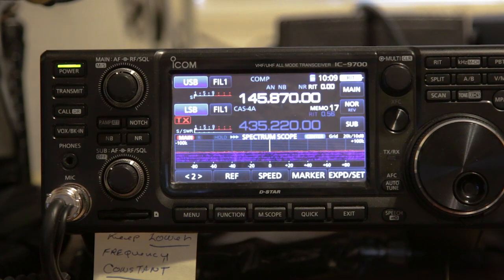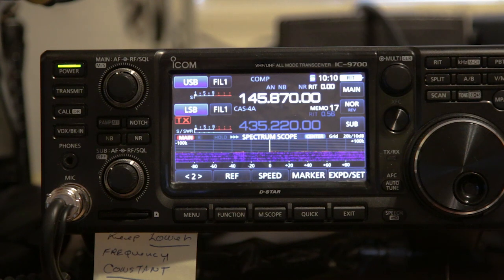Okay, this is Satellite Charlie Alpha Sierra 4 Alpha, CAS 4A. It's going to be arriving in the west. It has already arrived. We're getting real close to the 20 degree mark right now. It'll be flying from west to east, just about due west to due east. So it'll be an easy satellite, or an easy antenna track. Be pointed west until it's directly over, and then we'll switch over to east. We won't have to change the antenna but only once. And that's for a 180 degree switch from west to east.